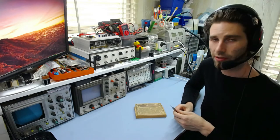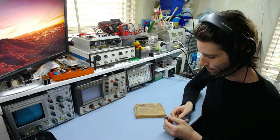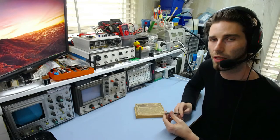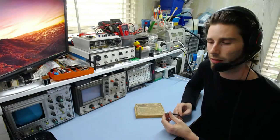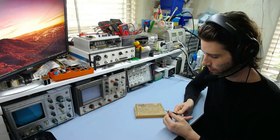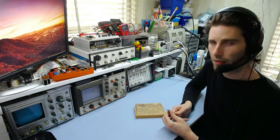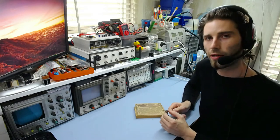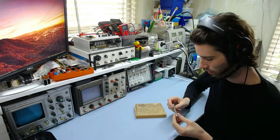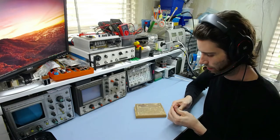What was I saying? Oh yes, the drill bits. So the drill bits you typically probably want for most components are about 1mm or 0.8mm. Drill bits of that size are generally quite hard to get in standard hardware stores, so eBay is probably your best choice for that. If you want to get those, make sure they're, like I said, high speed steel, just standard steel. You don't want to get the solid tungsten carbide ones, they'll break far too easily. Only use those if you've got a drill press or such like with good precision that isn't going to wobble around and snap things. And even then you'll probably snap a few to start off with.